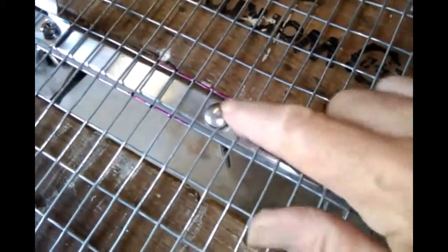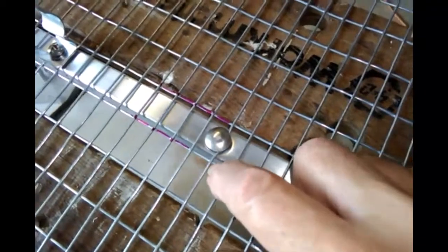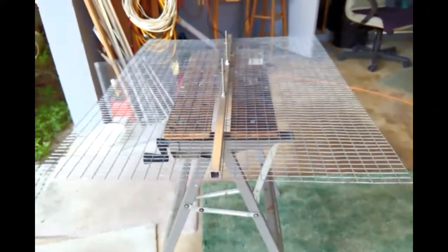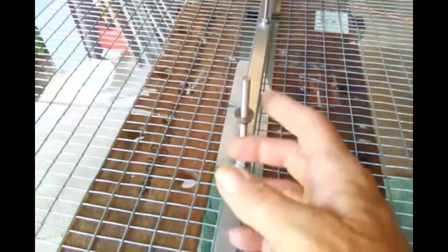So I have a bottom mount — this is the through bolt. I've turned this over and put a washer, a lock washer, and tightened that down. Here's another mount, another bolt, and up on the very top there's just a washer, a lock washer, and a screw — that holds it securely and keeps everything together. So we have a very flat reflector mounted to its backbone. I've run the posts through and attached these with a nut and a flat washer — don't put a lock washer there, you don't need it. And we're ready to mount the antenna element.